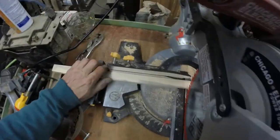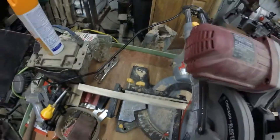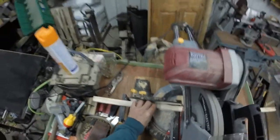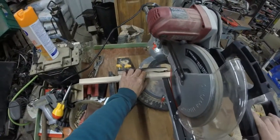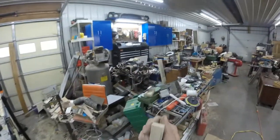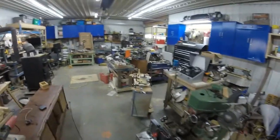So, you guys all do it differently. I parked the blade on there. I scored it with a knife so I don't have tear out. Let's see how well. Ears. On the money. No tear out. Both sides. Razor knives or a scribing knife. Yeah. A little bit of roughage there. So, I'll go to the belt sander.